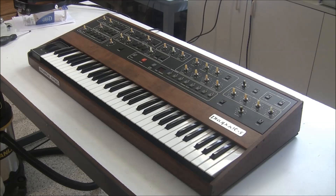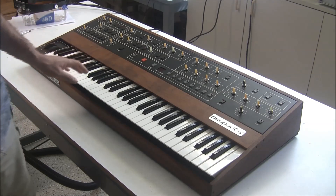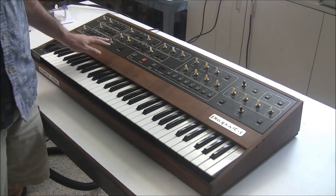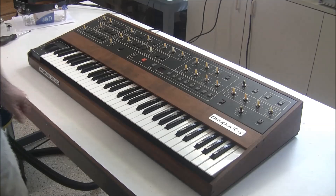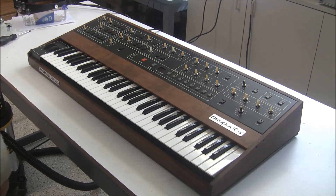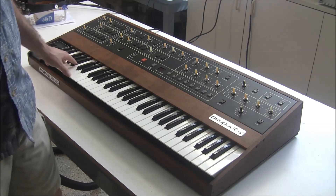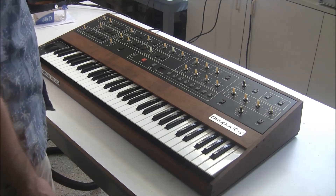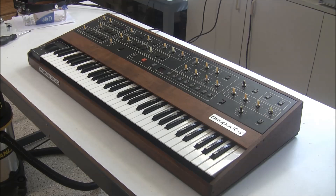In this video we completed the recap of this keyboard — we changed all the remaining tantalum and electrolytic capacitors on the remaining four boards: the pot boards, the CPU board, and the analog board. We did the power supply in the previous video. We also changed the broken potentiometer and checked and changed the battery. Now we're ready to fire the keyboard up and see if the recap is all it took to bring this keyboard back to life — and we will be doing that in the next video. This is Synth Chaser from synthchaser.com. Thanks for watching. Be sure to subscribe so you don't miss the next part. I have parts and repair service for Prophet 5s on my website, synthchaser.com.